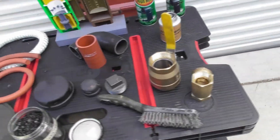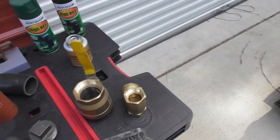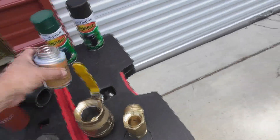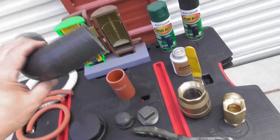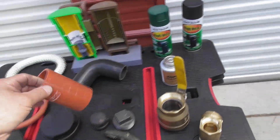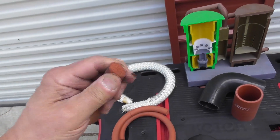We've got the wire brush for the threads — we'll clean off all the ball valves and the threads on the clean-out ports, then put some anti-seize lube. I use copper coat high-temperature anti-seize lube. For any silicone adapters that need replacement, I have these — they're rated at about 350 degrees, and the orange ones are rated at 500 degrees.